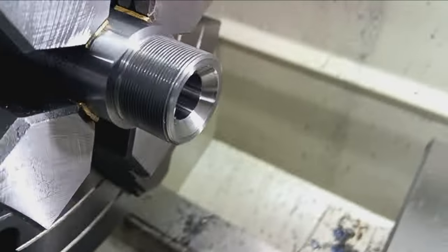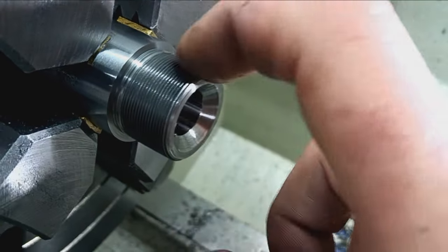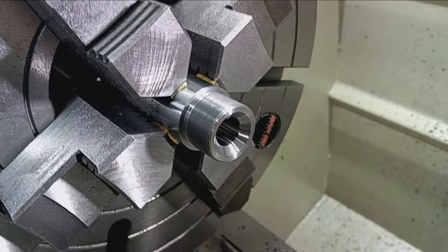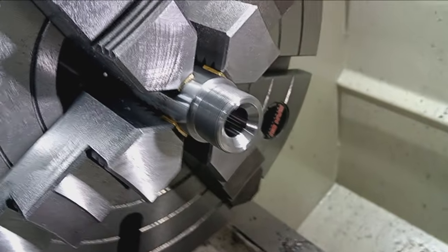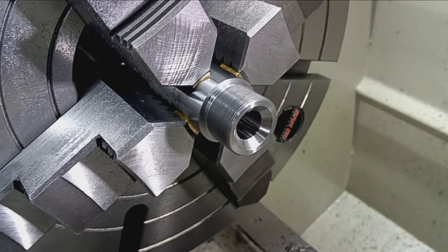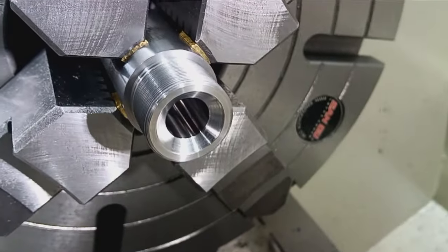So we got, again, just a perfect 90 degree transition from the shoulder to the barrel tenon thread. Everything's been machined in the same setup. Zero runout. Using a 1/10,000th indicator, and you saw that earlier. There was no movement in the needle here on this breech end before I did any of this. Checking throughout the entire process. Honestly, didn't have to recenter really at all. Kept checking and didn't have any fluctuations. So this is very rigid. I mean, this chuck is enormous. So the barrel didn't move throughout the entire process. Headspace has been achieved. And yeah, everything turned out real nice.